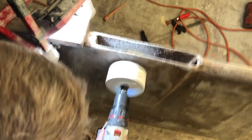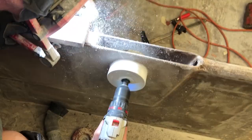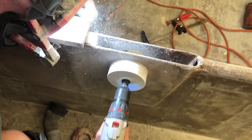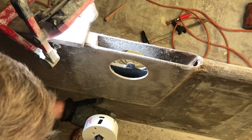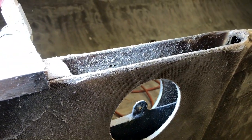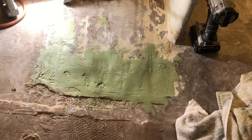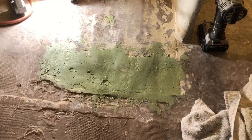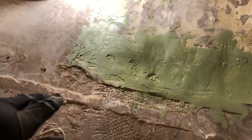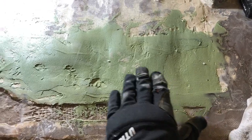I'm drilling a four-and-a-half inch hole here so I can access the pin. I'm going to put in a waterproof hatch on both sides, but note that it's a four-and-a-half inch hole I'm drilling for my four inch hatch. So be sure to check the actual size of the hatch before you believe the numbers they say. Pro tip: when you're working with epoxy or especially thickened epoxy and you might have some extra, have an area prepared so you can apply it. I'll keep adding to this as I have extra epoxy — I have lots of holes to fill.